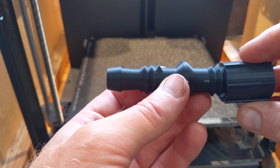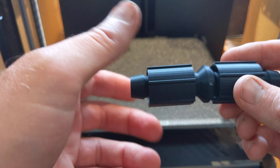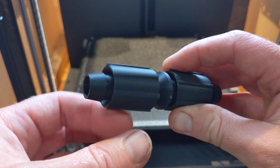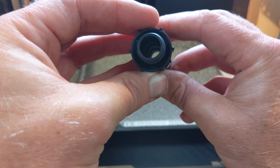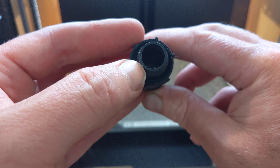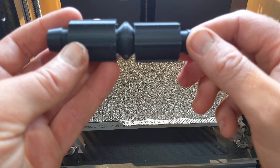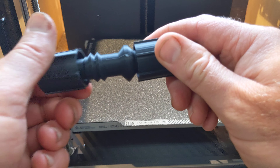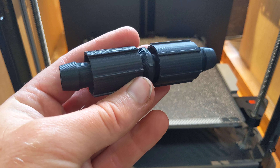There's a right way and a wrong way to screw these on. Look at that smooth operation. I made the threads a little bit looser, so there's a little bit of give, but they're never going to actually come off. So you're going to get a nice compression seal with that. If you look on the inside, this is something you'll never see in injection molding — the wall thickness of this cylinder here is 1.2 millimeters, and the internal profile perfectly matches the external profile. So you're basically using the absolute minimal amount of material.